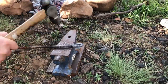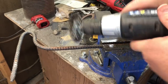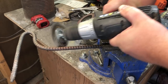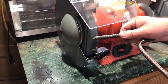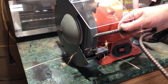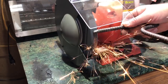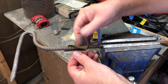Once I'm satisfied with the look of the coal spreader, I'm going to bring it inside and clean it up. You can put as much effort into this or as little as you want — it's meant to be used in a fireplace or forge so it's going to get dirty and beat up. But I do put a little pride into a piece like this. You'll see me use a few different power tools as I clean off the rust, oxidation, and scale. Probably the easiest cleanup would be a wire brush on an angle grinder or bench grinder.